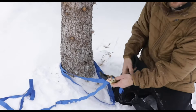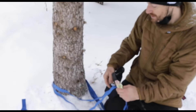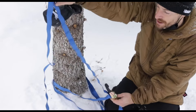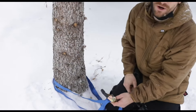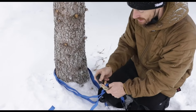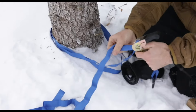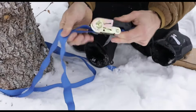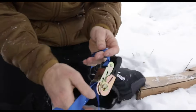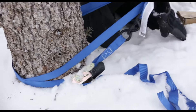When you find your base anchor for the bottom end of the unit, whether it's your return or your powered unit, you're going to make sure you pull out enough extra to cut off and use as a tether for the come along on the powered end. Then you're going to ratchet this to get the tether strapped tight in the ratcheting section, and then you'll hook both S hooks together to make a continuous loop around the tree, just like so.